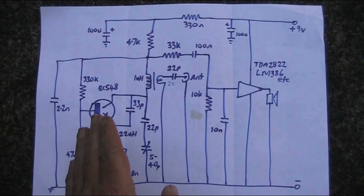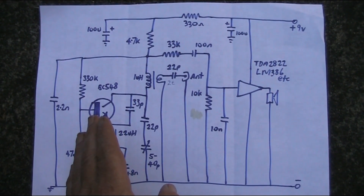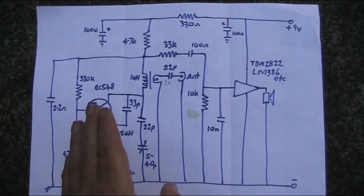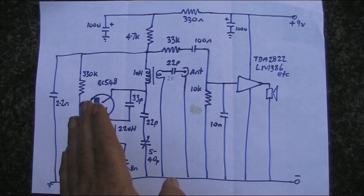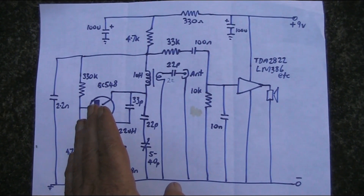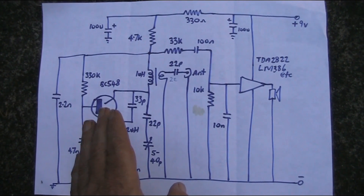The limitation is that the selectivity is quite broad, and it's also restricted in the modes that it receives. It's good for AM reception, like those powerhouse stations on 27 MHz CB — they're all on AM, so that's fine. No good on SSB. Narrow band FM is a struggle. Wide band FM sort of works.